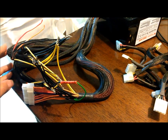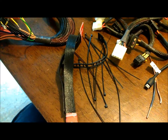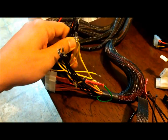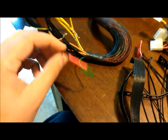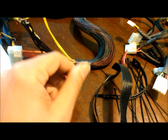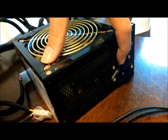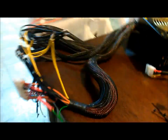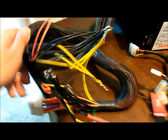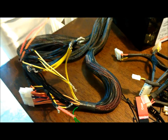If you refer back to the picture of the amplifier, you have a space that's probably about this wide where all of these plugs need to fit. In order to do that, I'm going to be using cable ties to put everything together. That way you have all of your black wires together and all of your yellows together. I've already paired the green wire from the motherboard's main connector to one of the black wires — this will let the power supply know it's on once you activate the switch. Right now I'm going to take some time to compile all of these into a compact form that can fit in an area of about an inch and a half, because that is the challenge here.